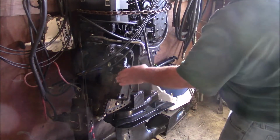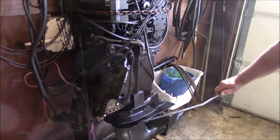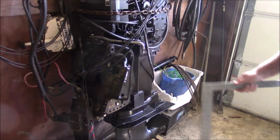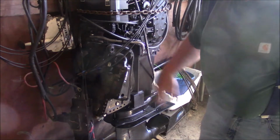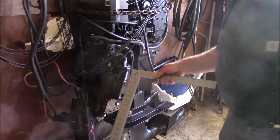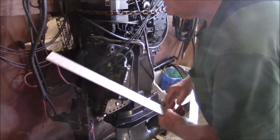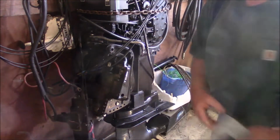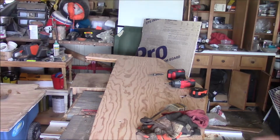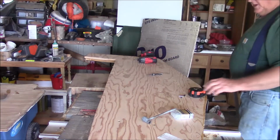You know, they give this amount of options so you can actually jack the outboard to match the bottom of your hull. You can put that fin right at the bottom of the rear part of the bottom of the boat. You know, jack that motor up a little bit to sort of optimize things. I'm not going there, but they have all these different holes where you can move that motor up and down on the transom just a little bit. So yet again, let's go with 10 or 11 inches, and 13 inches apart. So the Johnson's 10 by 10, that one's 13 by 10. So let's do some measurements and see whether or not those support screws right here and here have got themselves in the hit zone of one of those motors.